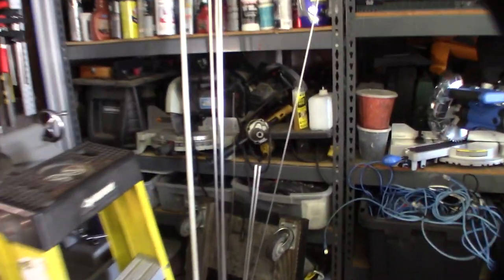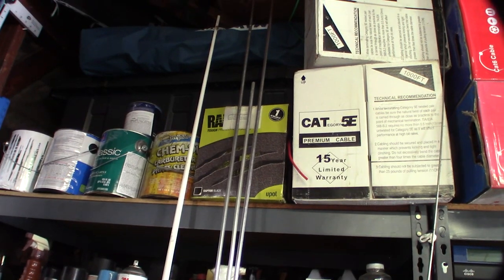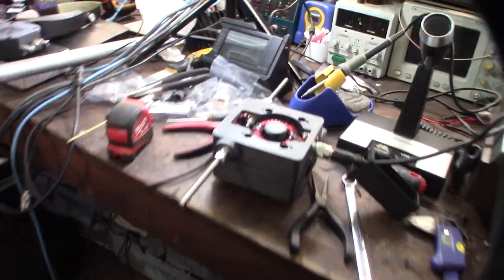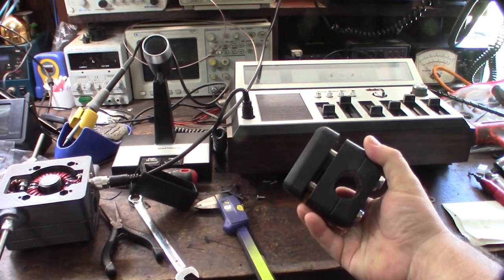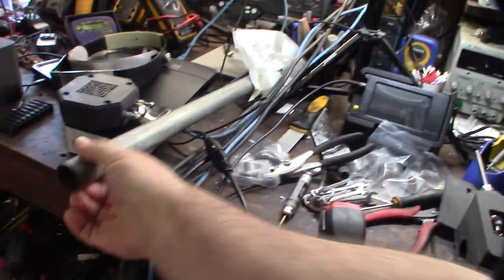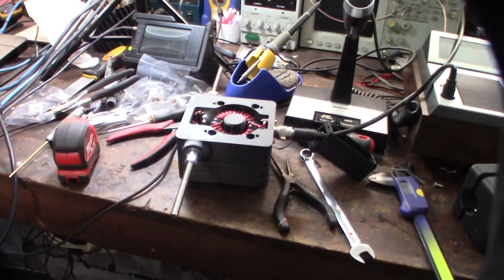I'll show you the rods. All right, here are the rods. I guess I can get them down now. I have them pre-cut and already pre-threaded. It's an M8 thread, and I had to use a long tap. I want them to be adjustable so I can really dial it in. I was saying this can be either horizontal or vertical. On the vertical side, I have this changer. You can buy one out of metal for pretty cheap too. So I can mount it directionally going out for vertical. But I'm going to try something else, because I already have another vertical antenna.